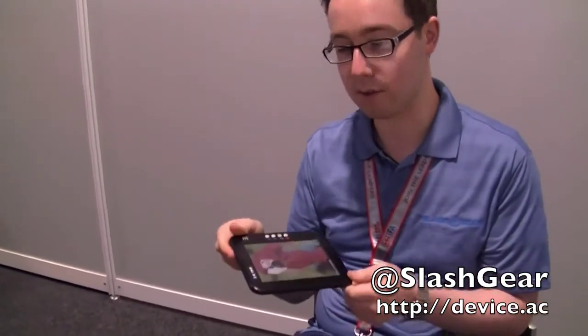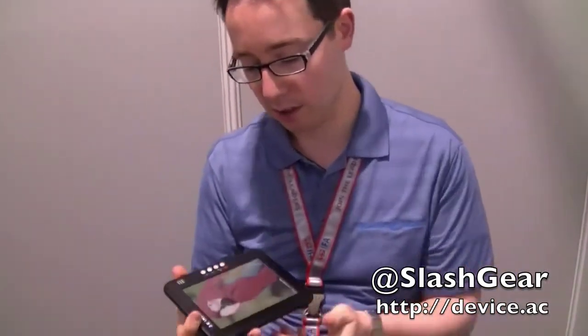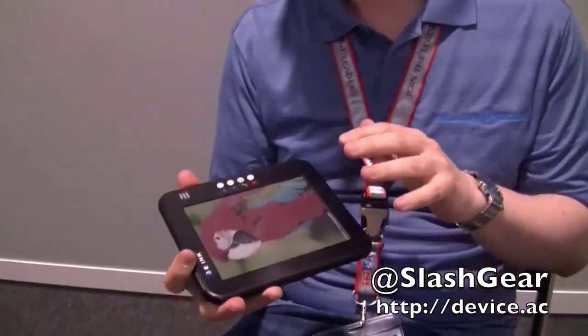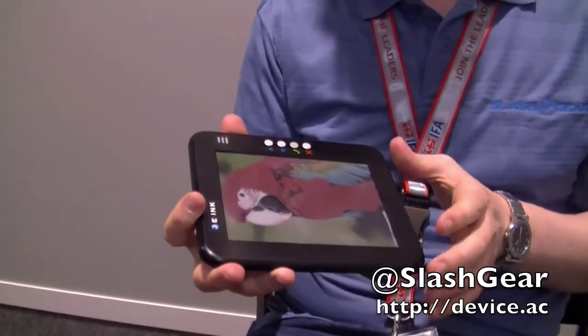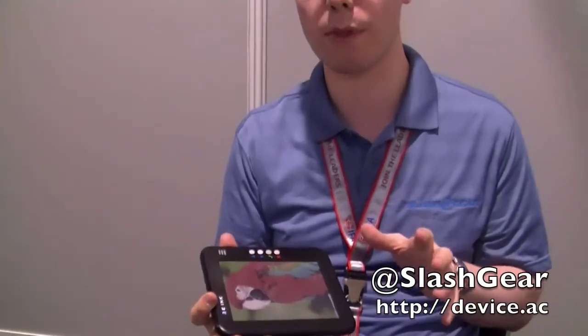This is in a sort of demo mock-up reference design hardware, but there are already two companies with products already announced and there are more in the pipeline. This is running at around 160 ppi. E-Ink is working alongside Epson to develop a panel and the driver hardware for it which will run at around 300 dpi, giving even more refinement on the text and images.